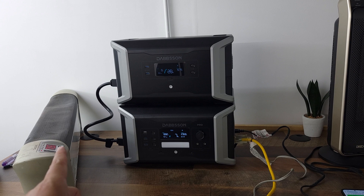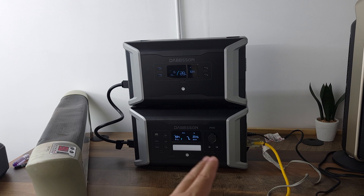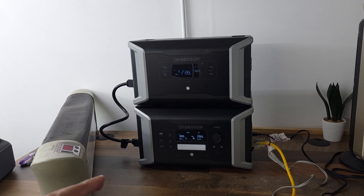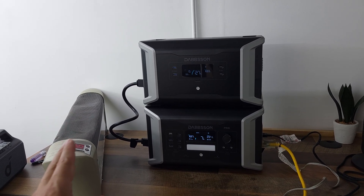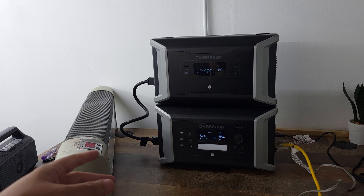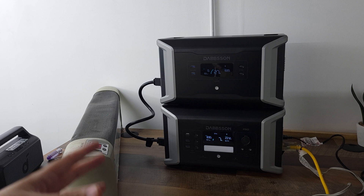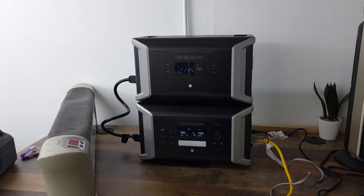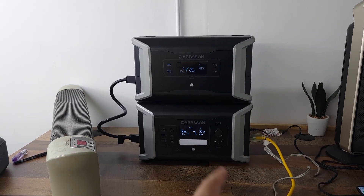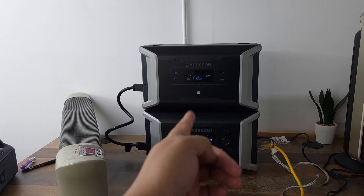Another thing I realized is at full wattage, these appliances actually want to draw more than that 2300 watts. When I first turned them all on, it was around 2900 watts. But this power station has a feature called P-Boost, and what this does is basically scale down the power and run appliances like this at lower wattage. If this was a voltage sensitive device such as a computer or anything else that requires its full power, then it wouldn't work. But with anything like heaters, electric skillets, air conditioners, or anything that's resistive and doesn't require its full voltage requirement to run, that will work on P-Boost. With other power stations, this would have just tripped up the power station and given you an error code, but P-Boost allows you to run more.